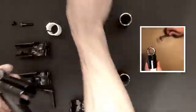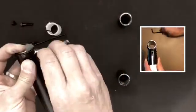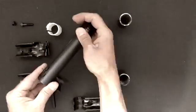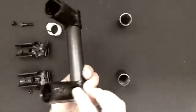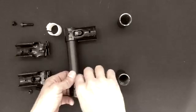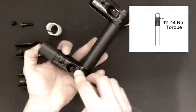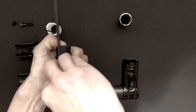Something very important to remember when inserting the tubes in the HJ joint sets: insert them all the way to the second assembly line to make sure they are properly installed. It is equally important that the nuts and bolts are properly tightened — 12 to 14 Newton-meter torque is the right tightness. In other words, make sure to feel the bolt pass through the nut at least one or two threads on the other side to confirm they are secured properly.